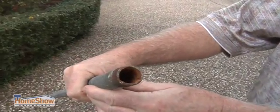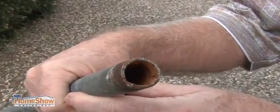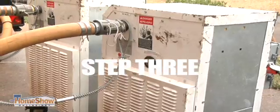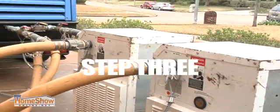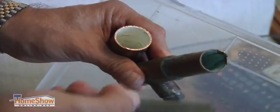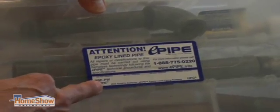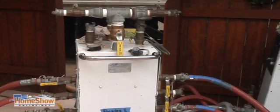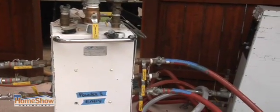That's what the pipes look like. In certain sections of our house we had actually yellow, rusty water. Finally, the pipes are coated with an epoxy lining which seals all the leaks. Once we have the epoxy coated and we've initiated the initial cure, on the third day we'll come in and start putting back the angle stop valves and the supply tubes. We use all new supply lines as well as angle stops. Then the system is pressure tested to make sure that we don't have any pinhole leaks at all.